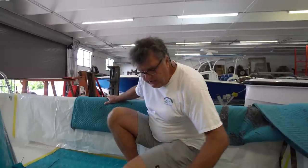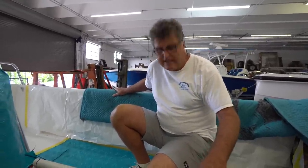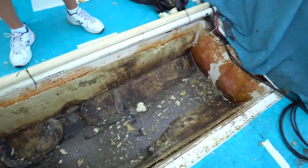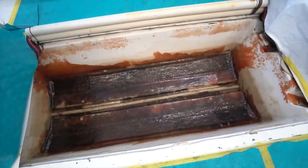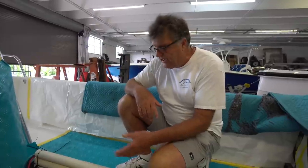They plugged the bilge and added water, and they noticed that water was just gushing into this fiberglass pan that the gas tank used to sit in. It had a lot of salty, dirty, smelly water in here when we pulled the tank out. So what they did was they laminated fiberglass over all the small little holes that were letting bilge water and salt water into the bottom of our tank. Now it's watertight. So now we're gonna start fresh.